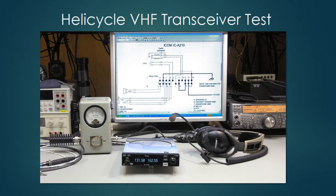I'm going to be talking about VSWR, pronounced VISWR, which stands for Voltage Standing Wave Ratio. It's basically the ratio of how much power is being transmitted to the antenna versus how much is being reflected back to the radio instead of being radiated.